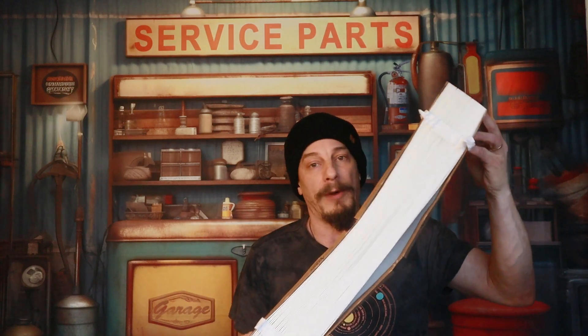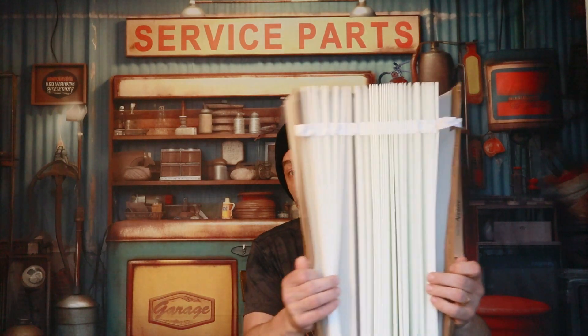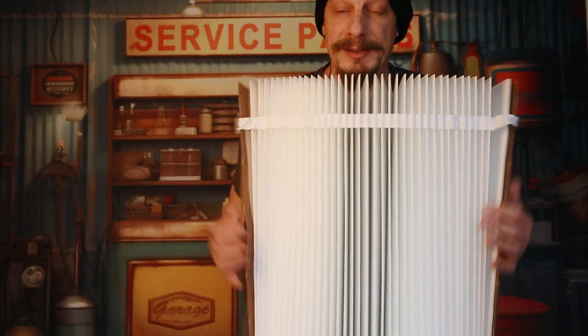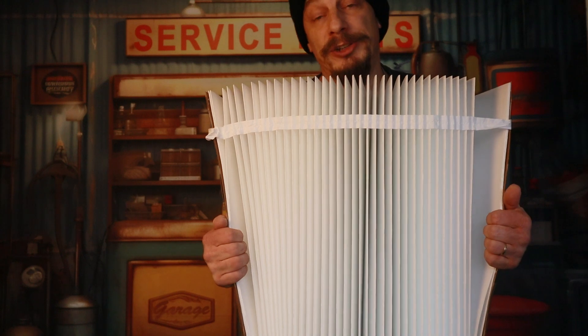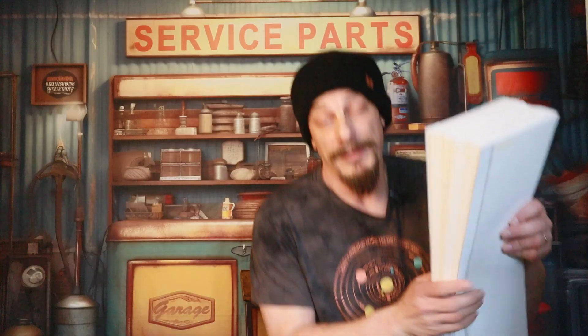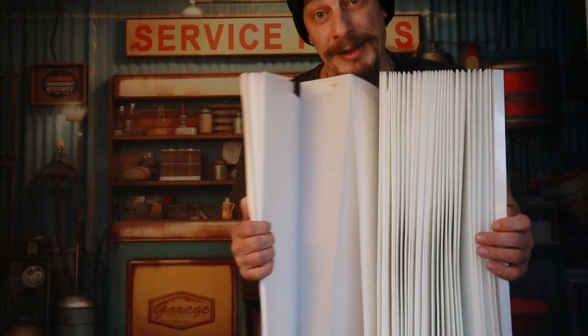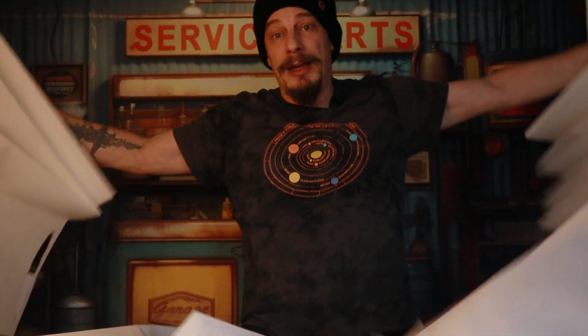You're getting better filtration but not adding more static pressure to the system. Here I have a filter that goes into a rack. These types of filters have black combs that sit in between all the folds so you can stretch it out - the same principle as the four-inch media filter. These filters are a pain to change, but the good thing is you only have to change them once or twice a year. You can also get filters that are six inches thick, which gives you tons of surface area. If I were to stretch this particular filter all the way out, I'd probably have about 50 square feet of surface area - that's great for your system.